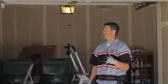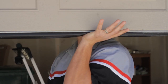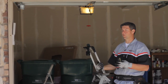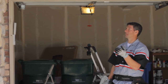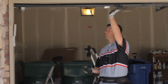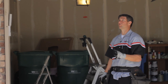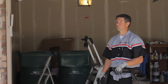The first step is go ahead and hit the button, bring the door down, and physically catch the door to feel how hard it's pushing. Make sure it's not pushing so hard that it's going to bend your door and do any damage. Go ahead and hit the button, then catch the door and feel how hard it's pushing. What you're looking for is just enough force to get the door closed, but not push so hard it's going to damage your door.